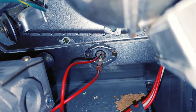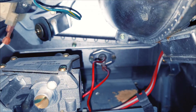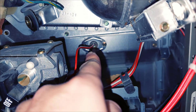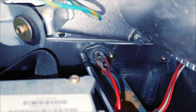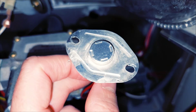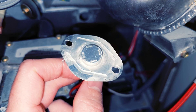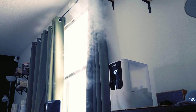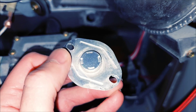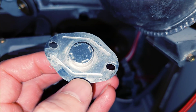That is my overheat sensor. It has two screws on it and basically looks just like that. There's also another sensor right back here, but this is not the one — I believe there's about three sensors in these furnaces. Once you remove the screws and get it off, you're going to need to wipe the sensor, which is that circle right there. One thing I have is a bunch of ultrasonic humidifiers running in my house, and they produce this white dust — you can see it right here. It literally just wipes off with a cloth super easily.